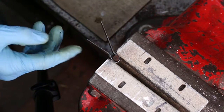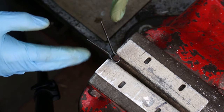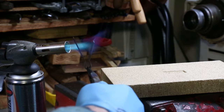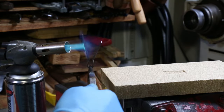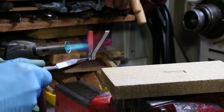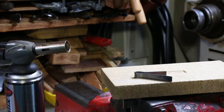The best thing to do here is heat up both of these sides to red heat, which will upset the temper in the whole spring. Then we can bend it to the correct shape and then re-heat treat it to bring the spring back. I've turned the lights down so we should see it when it starts to glow a dull red - I don't want it a bright cherry, just a dull red. That's the long side at dull red and that's also a dull red, so I can now place it on the fire brick, turn the blow lamp off, and let that cool down.